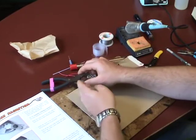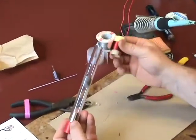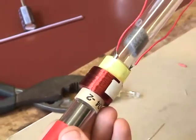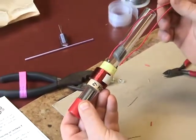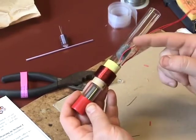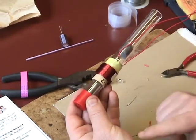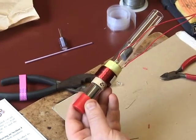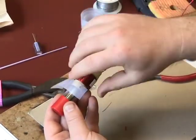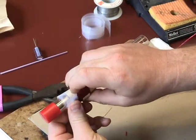Place the circuit board aside as we're ready for step 8. In step 8, you will need the pre-assembled tube and the coil. Slide the coil over the plastic tube and slide it down towards the red plastic cap. Make sure the wires coming off the terminals are pointing towards the open end. Also make sure the sponge rubber bumper is below the quarter-inch hole drilled all the way through the tube. Center the coil between the red plastic cap and the sponge rubber bumper, then take a piece of scotch tape and tape the end of the coil into place on the tube. You do not need a lot of tape as this is only temporary.